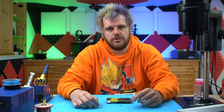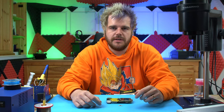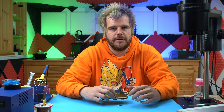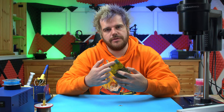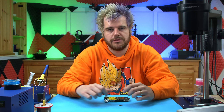If you're into modding Game Boy Pockets or Colors and you've installed an IPS kit and an amp, or maybe one and the other, you'll tend to find that the system just powers down or takes two attempts to power up, or you get unstable behavior. This is due to the stock regulator on the Game Boy Pockets and Colors not being able to provide enough power for these new mods.